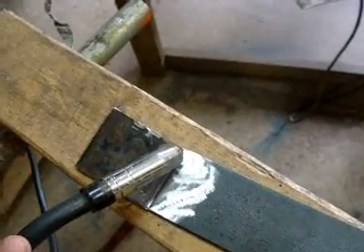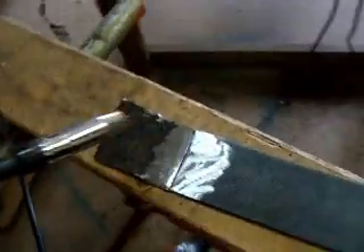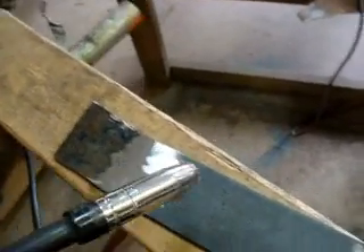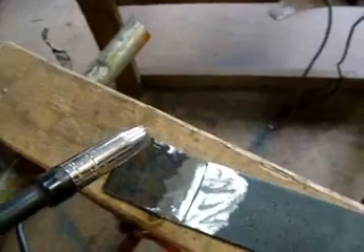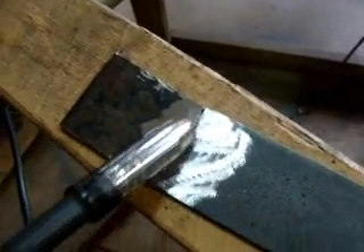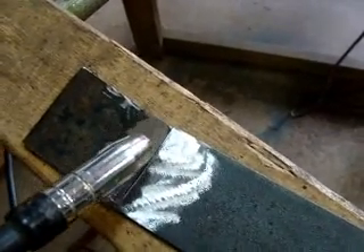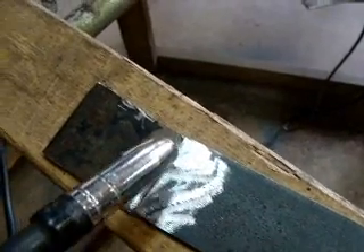This is live wire, so there's always current running through the wire. With these welders you want to keep it away a bit and let the wire touch the metal, instead of you touching it with the wire. Get it about where you want, then put your helmet down. What you want to do is probably do a tack — just a small little weld right there, and then one right there — and then do it on the same side on the corners or on the opposite side. There are a couple different welding patterns you can do: you can do a straight bead, but that doesn't get very good penetration on both pieces, or you can do a C-shape, back and forth, kind of overlapping them.